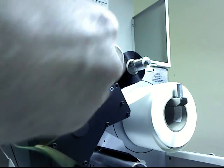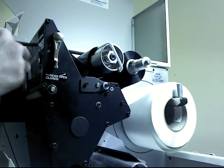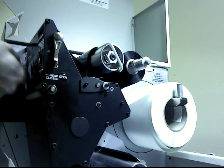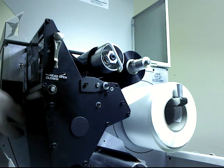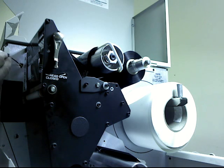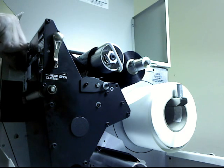At first it looks like it's not going to work, but it will actually fit through the little tiny hole. So the top one has the green and yellow wires. You just bend the wires down like that and then shove it through the hole. On the back side there's some electronics you have to route it around, and then put it in facing down, so the electric eyeball is facing down, and then secure it with the screw from the back side.